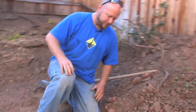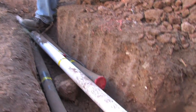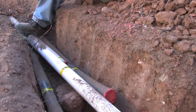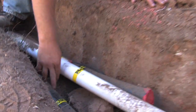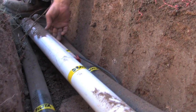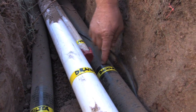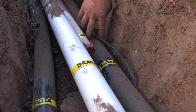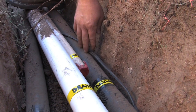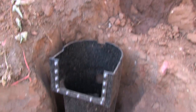As you can see here, we have four lines running through here. Sometimes all these pipes are white PVC, sometimes they're all black PVC. But what we've done here is we've marked each one of them. This is our filter line, this is our drain line, this is our air for cleaning, and here's our back flush for washing the system out. We've also tied in our low voltage line inside this trench as well. We've ganged everything together — we dig one trench and we run it over to our location where we're going to do all our filters.